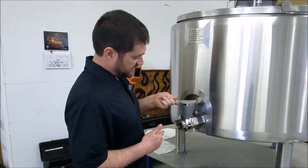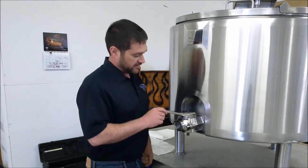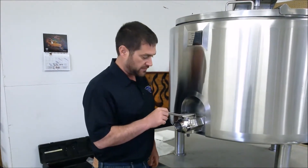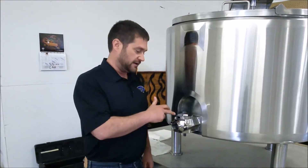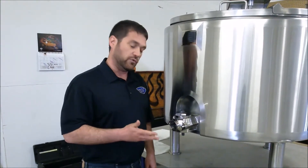When we put the plug into the valve body we gently put it in there, and we can notice with the lubrication that we can go from the closed position to the open position very easily. If we don't have the lubrication in the valve properly, the stainless plug and valve body will grind and that will cause scratching, and we don't want that on the plug.